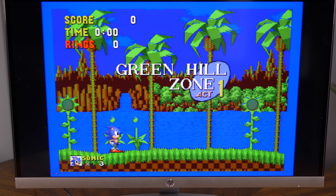You could really see all of the interference get highlighted here, and it really stands out. That's why so many people chasing the sharpest pixels possible and the highest scale image do things like RGB mods and RGB bypasses to enhance and clean up the signal. If that's what's important to you, that's absolutely awesome, and stuff like the OSSC is the right choice for you. The RAD2X cables are meant as plug-and-play beginner solutions, or as backup solutions for experts that already have those other setups. Since it's only scaling 2x to 480p, a lot of these interference issues like jail bars aren't picked up as well, so it blends in nicely.